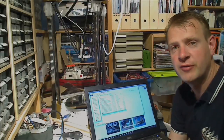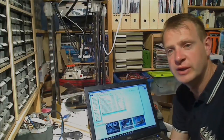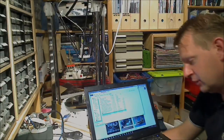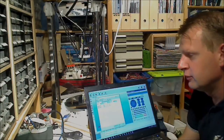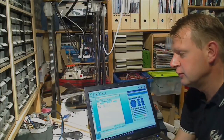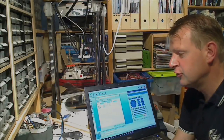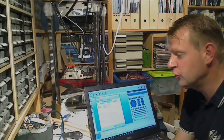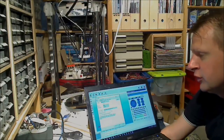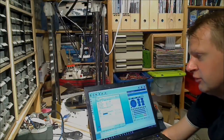So now we downloaded our calibration objects. Now it's time to go to our printer software, which in my case is Repetier, because I like it better than Pronterface. I set Repetier up like this. So it's a rostock printer, circular shape. Home X and Y 0. Home Z is max. Printable radius 220. Printable height 216.1 millimeters. Connection is all about the COM. And I believe this is all pretty much irrelevant.